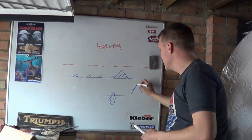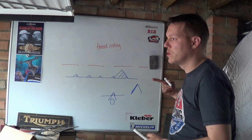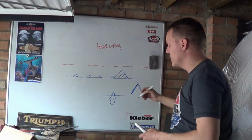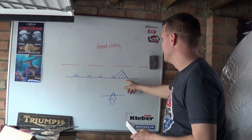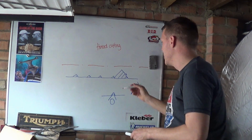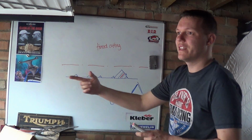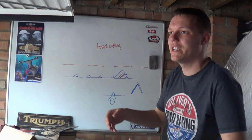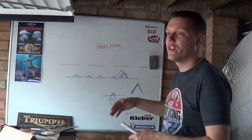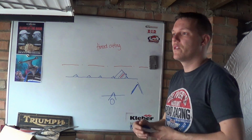So you're only cutting on this side, you're only chiseling away on one side of the tool, and that's the side being fed in. The back side of the tool is basically just rubbing, it's not cutting at all. And every time you take a cut, it's only rubbing on this section here, where the cutting chiseling surface is a lot greater. And obviously you're feeding in that direction, so basically it stops chatter, and it increases the tool pressure, should I say, on the flank that you are feeding into. The back side of it is just like the flutes on the side of a drill.